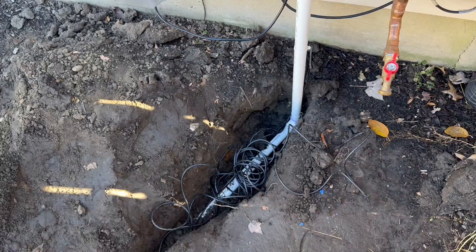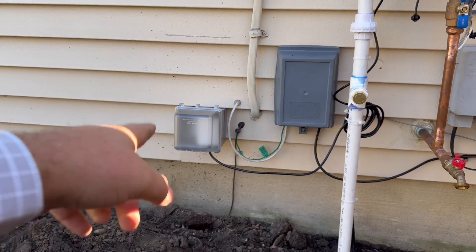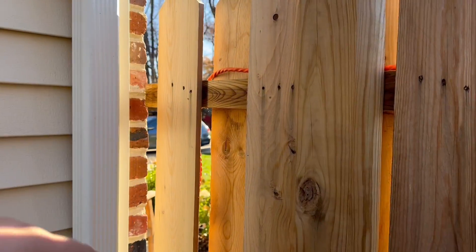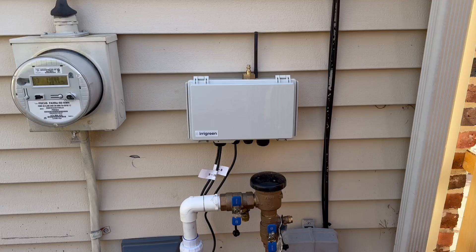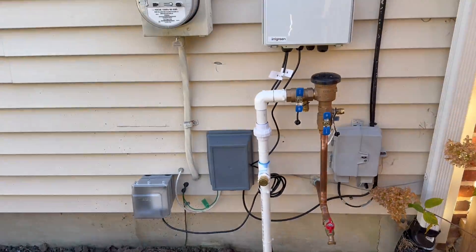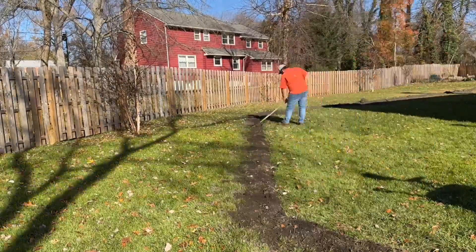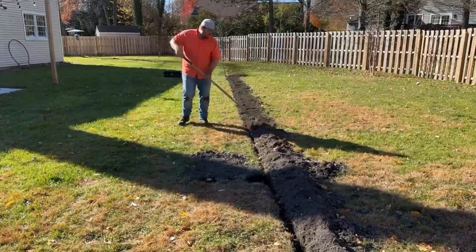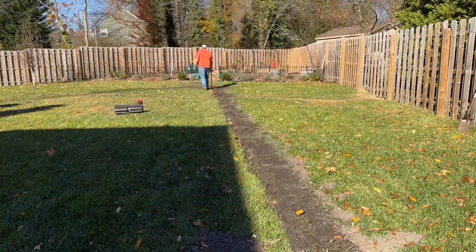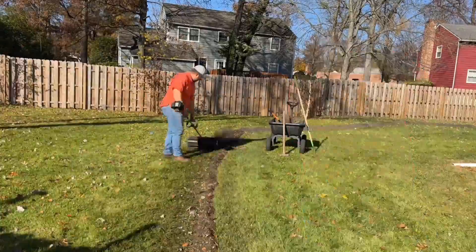I'm going to get another valve box to coil up all that wire and bury it right there. We did get an electrical outlet installed — approved for outdoor use — for the transformer. Previously I had the iGreen controller mounted up there temporarily, but now I have it mounted right there on the house so the cables can come down the back side of the pipe and into the ground. Everything is working, no error codes. We did reposition a few heads, but we are at a point now where we can backfill all of this and be done with this project. In the next video we'll be going over all of the setup in the app and calibrating heads.